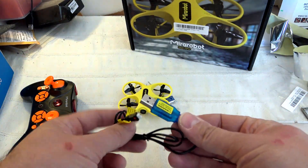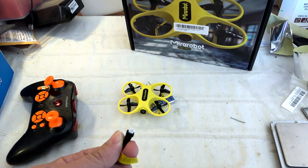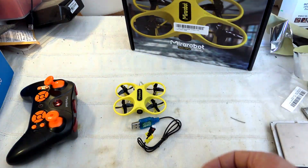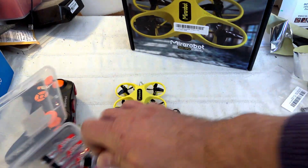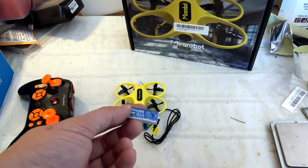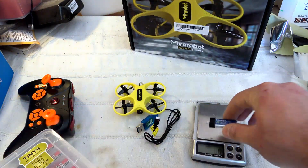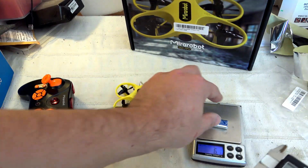There's a basic USB charging cable ending with a super micro JST, one millimeter pitch connector. The LiPo battery given in the bundle is much wider and shorter. It's a 200 milliamp-hour battery with a 40C discharge rate. The weight is about six grams — 6.1 to be more precise.